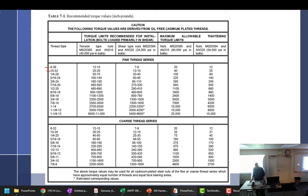All right, let's see. Several types of torque wrenches. We know that torque is not based on the head size. Although, I did once have a graduating student stretch out the bulkhead behind a spinner bulkhead on an airplane. He said, "I just can't get this thing to click." I asked what he was torquing it to. "2,300 inch pounds." Holy crap. Why? "Because it's a 3/4 inch wrench."